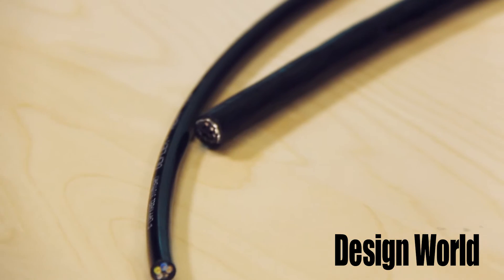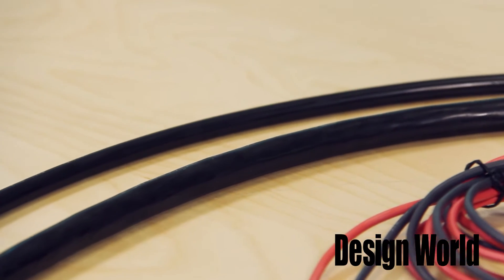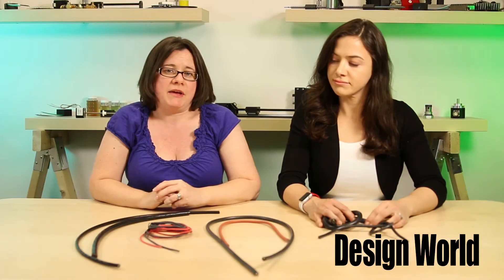That's why these cables are made from durable materials, like these two. The 180MS is a halogen-free silicone cable with a 180 degrees Celsius rating. It is also rated for use in North America. Its shielded counterpart, the 180CMS, comes with a tinned copper braid.